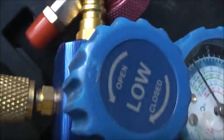It's actually working quite well, that R152a in it. I don't think I put any more than that. That's all closed. Look at the pressures. 5.094 amps. I'll just double check what the label says. Max load is 10 amps. That's max load. It does not tell me the nominal load, just the maximum load on this thing is 10 amps.